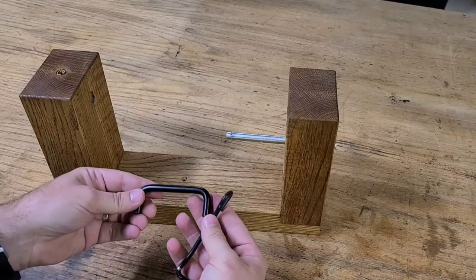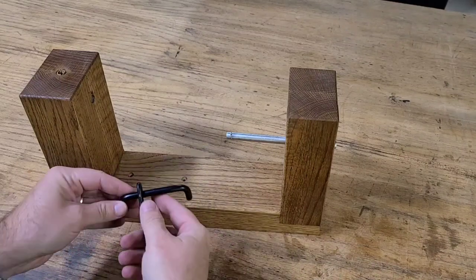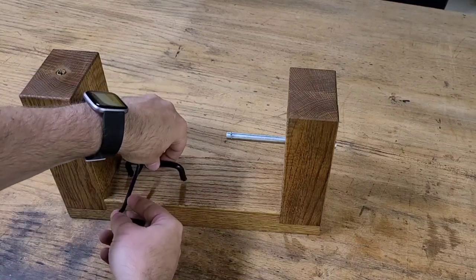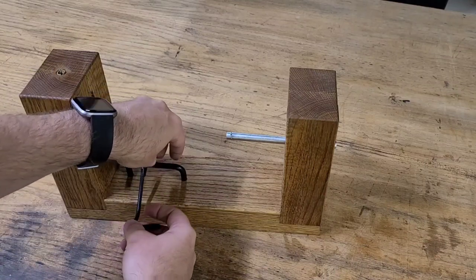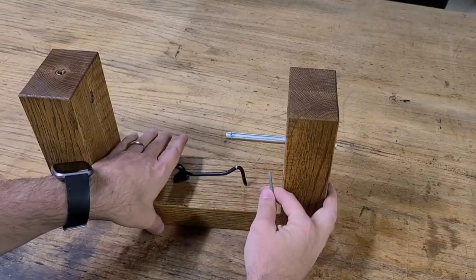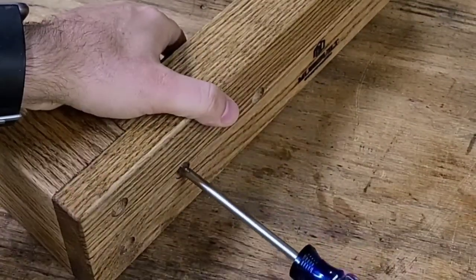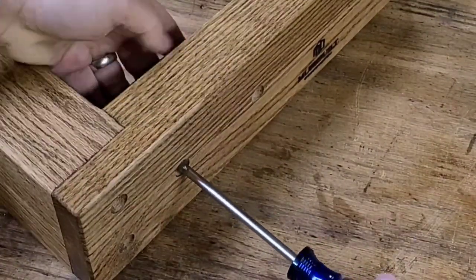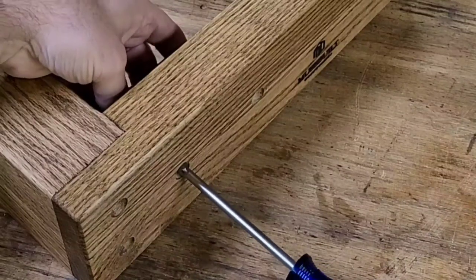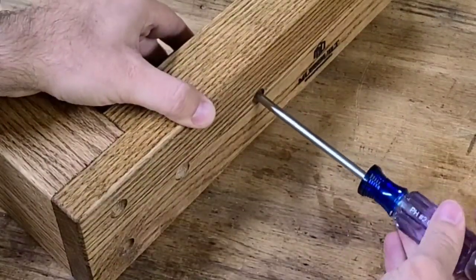So as I put this mainspring winder back together, I do want to mention that I made this using the tools that I already had in my wood shop. I used the table saw to make the rabbet joints. I used my router table to round over the edges of the frame. My miter saw to adjust the length of the wood. My lathe to make the wood to wrap the crank handle. And I used a drill and Forstner bits to drill the holes.